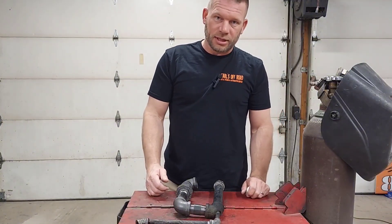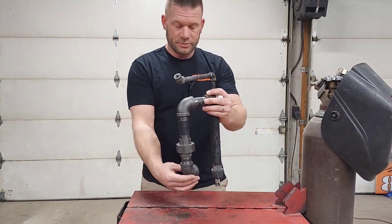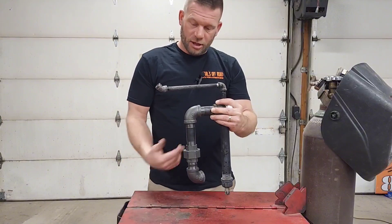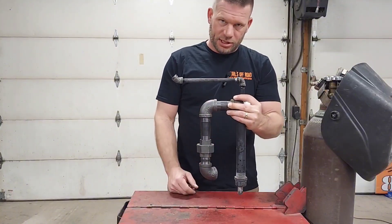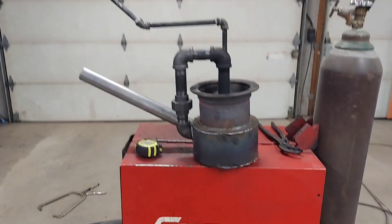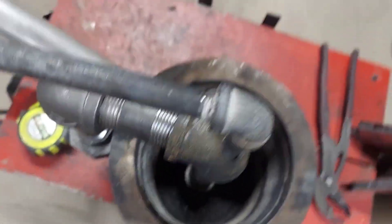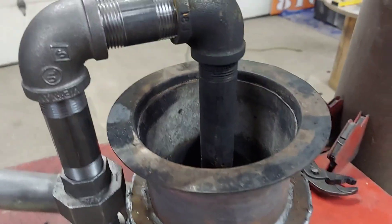I'm going to get to it here and I'll bring you back once I get that hole punched in the side. It's going to get welded to the side of the burner where it's reclaiming that heat, and hopefully that'll pre-charge the air with some heat and get this oil warmed up before it even gets into the chamber. So I'll do that and then I'll show you what the burner looks like when this is all welded together. Well, we got it welded up. I just kind of centered it in the middle of the burn chamber.